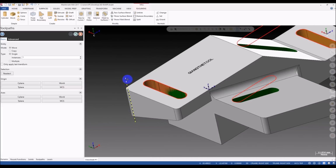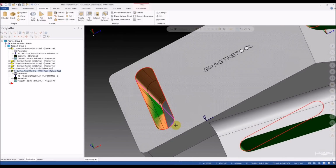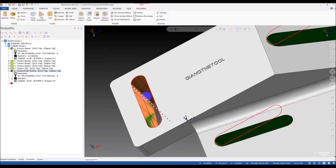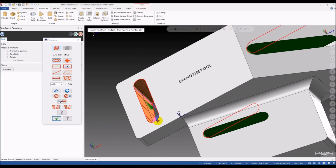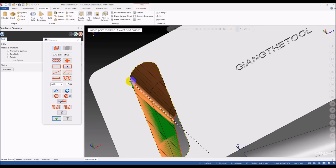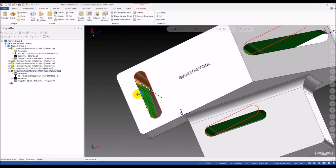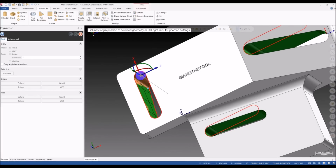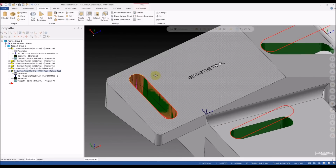Do not go like this. You don't want to push it in here, because when you make it here, it's difficult to select the start point of the cross contour. I will show you the sweep. When you select this, you can see the start point automatically moves to this point. This is a dangerous point we don't want. So it's best you move this to another point anywhere you want, but don't touch the cross contour here.